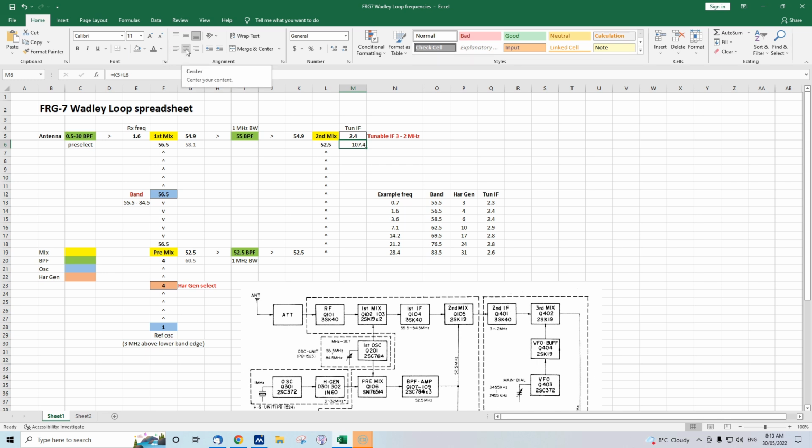Now, if you wanted to receive wideband FM on an FRG-7, arguably you could tap into the innards of the receiver and hold an FM receiver up to the FRG-7. You'd probably need a physical connection to the antenna, and you could actually use an FM broadcast receiver as a tunable IF. But that's wideband FM. You don't get that on HF, so that's just a curiosity.